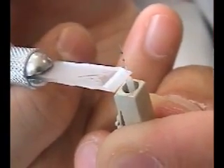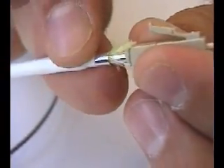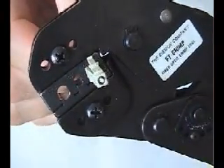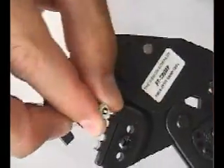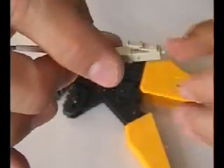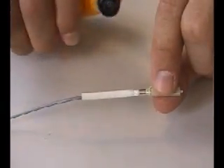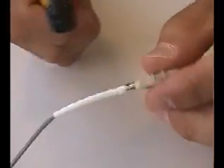Also, be careful not to bump or brush the end face before polishing. For jacketed fiber only, slide the crimp sleeve up over the aramid yarn so that it is seated against the shoulder of the connector housing. Be sure the sleeve does not move prior to being crimped. Next, position the crimp tool at the end of the crimp sleeve using the .12 opening in the crimp die. Crimp the sleeve by closing the crimp tool completely and releasing. For buffered only fibers, there is no crimping required. Simply slide the boot up to the back of the connector and snap into place. Using the small propane torch from the F-Term-LC kit or equivalent, carefully heat up the shrink tubing on all sides to provide proper strain relief. Hold the torch several inches from the cable, being careful not to overheat the tubing or cable to prevent damage.